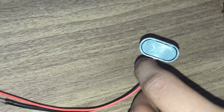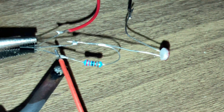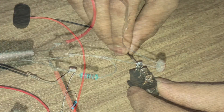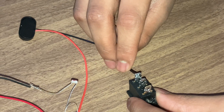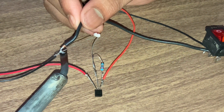This is the 9 volt battery connector. I'm going to connect its positive to the collector of the transistor. Now I'm connecting the negative of the 9 volt battery connector to a switch, and then the negative from the switch to the LDR.